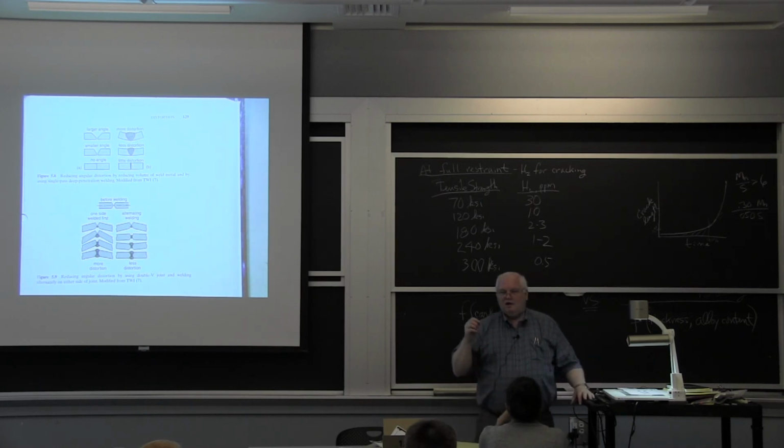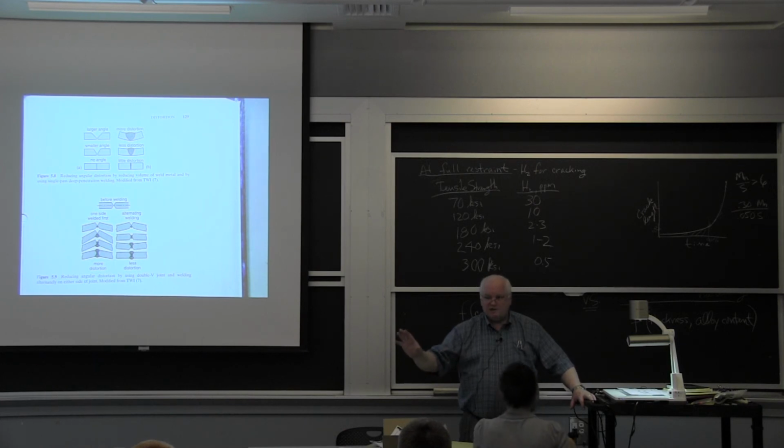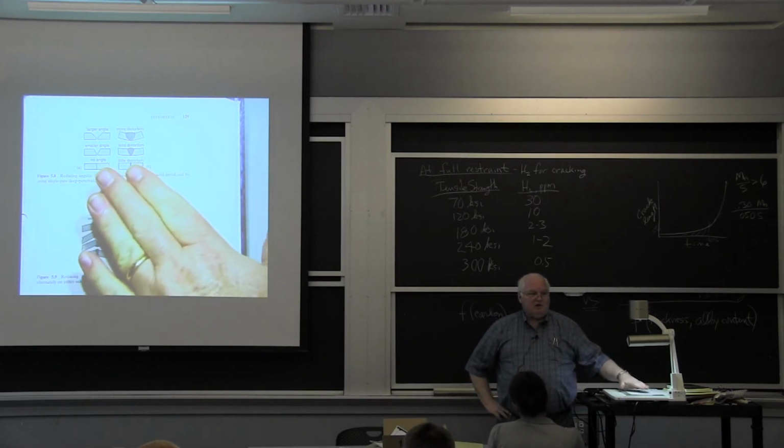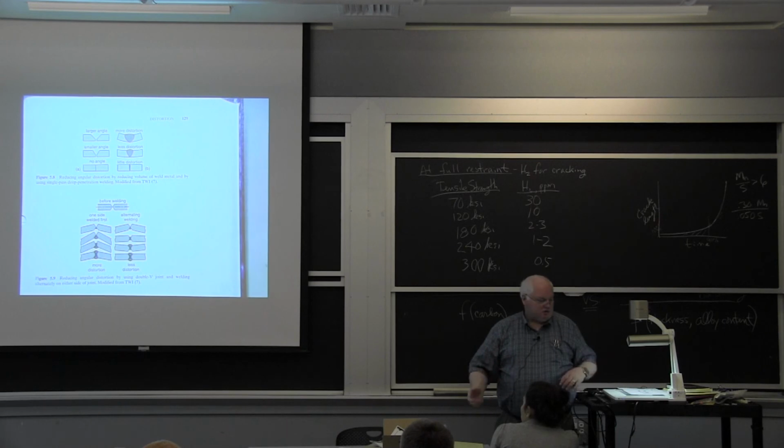But if you have a very highly restrained system, big heavy plate and egg crate type construction, and you have this in all your tanks and stuff you build inside, whether it's a surface ship or a sub, you have a lot of restraint, and the material can't distort. You put the top on a 6-sided box, and that last panel has nowhere to go because the other 5 panels are holding it in place. So the distortion is not distortion so much as it is residual stress. You can trade distortion versus residual stress.